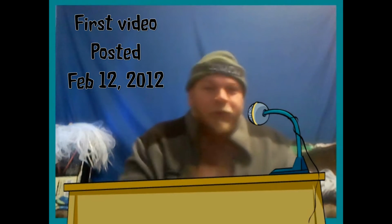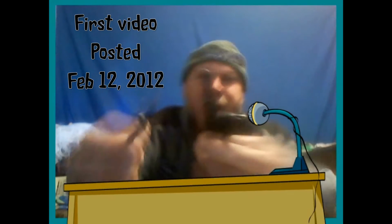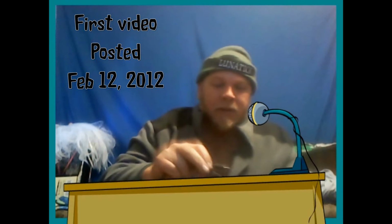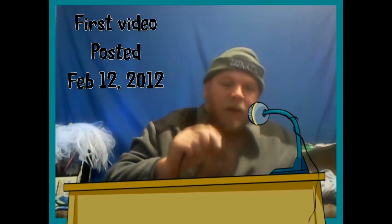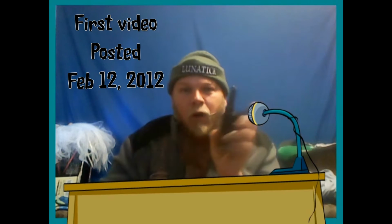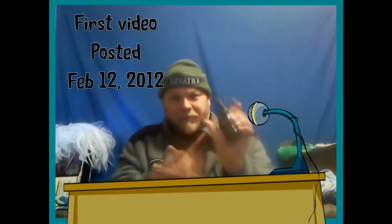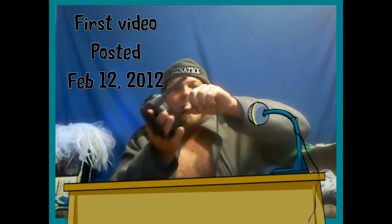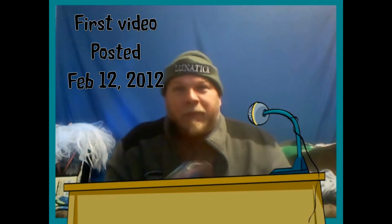What you do is you take your wire. You've got a male and male wire, male on both ends. Take one of them and make sure, okay, we've got our volume. We'll take one of them and plug it into the speaker hole, which is mostly for a headphone, on one walkie-talkie. Take the other end and we'll plug it into the microphone in on our camera.